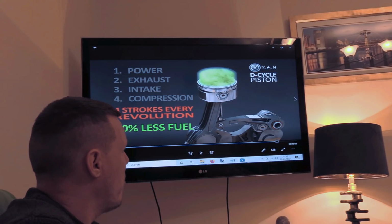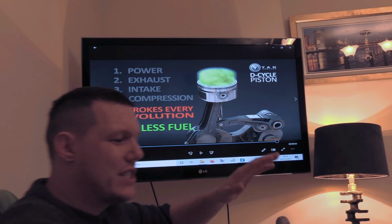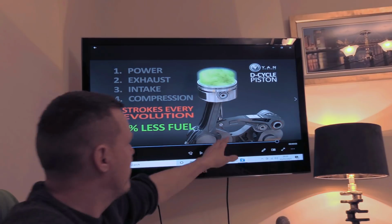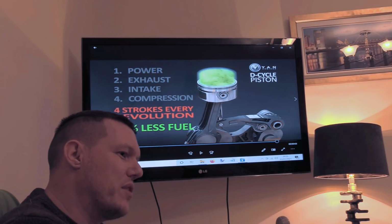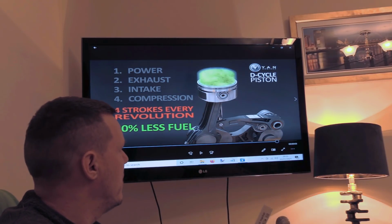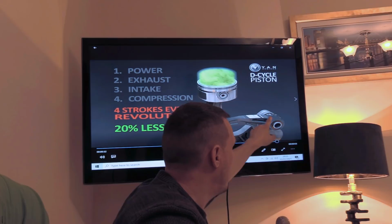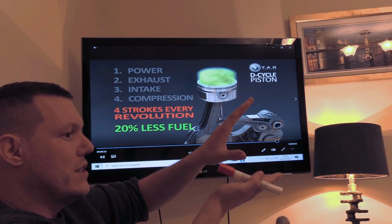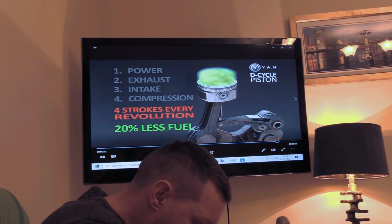And that force is mitigated to a degree, because this articulated rod here is actually sat on top of the cam. So if this was jerked up by this piston hitting it and carrying it up, it's not the end of the world, because there's nothing mechanically restraining you there, which we'll get to in a minute. Thermal expansion is one of the things that's actually dealt with in this, because this gap might nip up, but like I said, this is free to move out. If you put this roller on top and the cam on top of that, then you'd have some thermal expansion problems, because as everything expands, you'd be wanting it to move in a way that would pull it against the cam instead of away from it. So really not the end of the world.